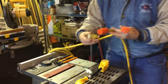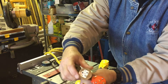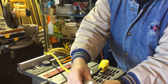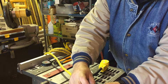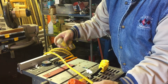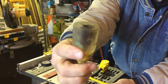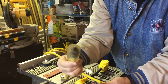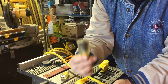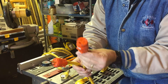Alright, so this has been rebuilt. Here's an issue though — you see that? The ground plug is gone. That ground plug provides extra safety so that you don't get zorched. So with that ground plug gone, it's time to replace it with something else. These are not that expensive — they're fairly cheap. So it's pretty easy to do that maintenance. And of course, there is the zorched plug — way overheated. And I wasn't even putting 30 amps of power through that, but over time, because it's only rated for 15, that's what's going to happen to it. So I had to build another one. Again, these are pretty inexpensive and they're very easy to wire.